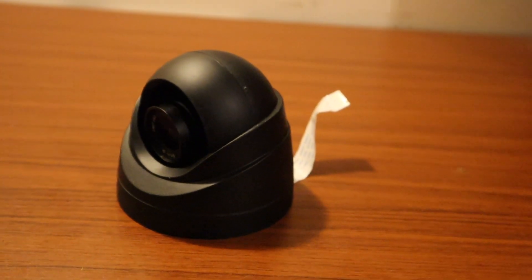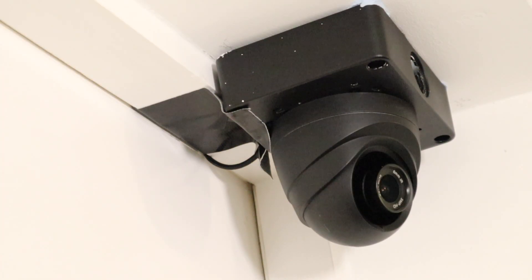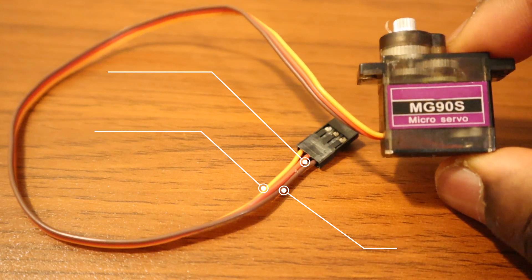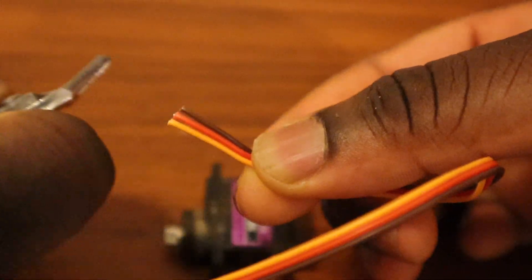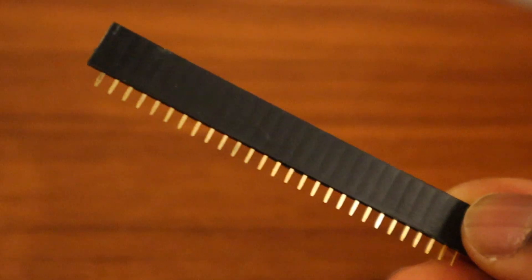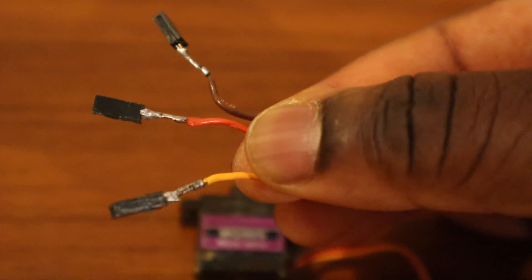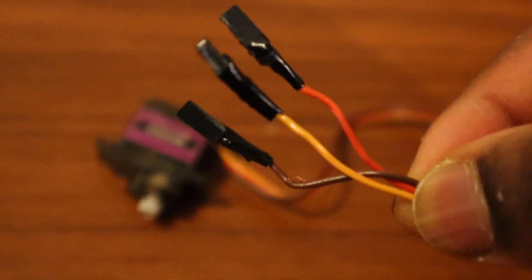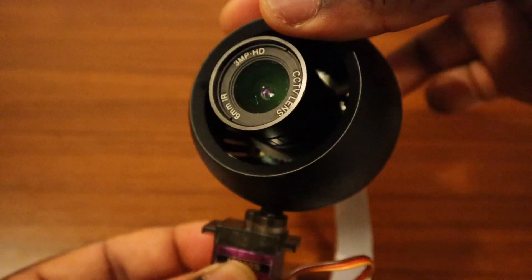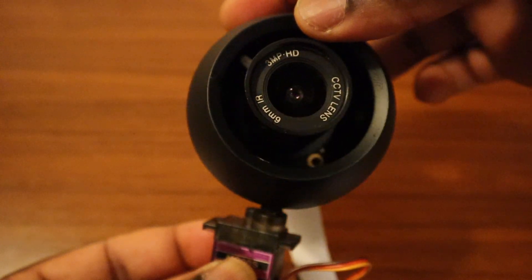You may be wondering, how do we make this camera rotate? To do this, we'll be using a servo motor, which is really good for accurate movement. This is the current setup of the wires. We'll be soldering these onto female pins and adding them to the Raspberry Pi header. We're just going to strip the wires and solder them onto the female header pins. We're going to add some electrical tape to avoid any short circuits. The servo motor also has a screw whereby we can drill a hole through the camera and screw it right through, causing the camera to move with precise precision.